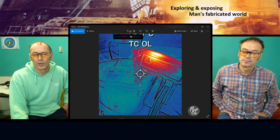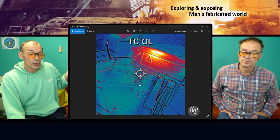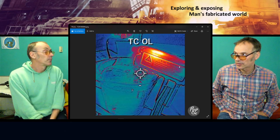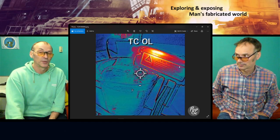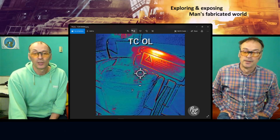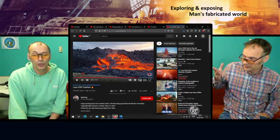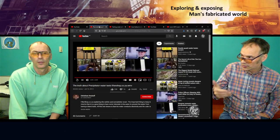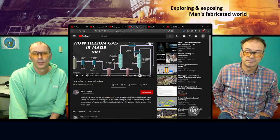But yeah, we can see this one. This is the one on the right, just the one with the distilled water. We can see how cold the water is, so there's not much heat being generated between the electrodes. So it's the heat that's being generated that causes a lot of the decomposition, or is the catalyst as well. That's quite interesting. And that would also explain why our titanium electrodes didn't produce a lot of heat, because there wasn't much conductivity between the electrodes. Sure, absolutely, of course.